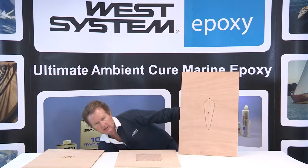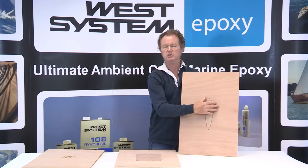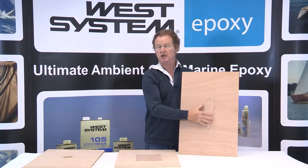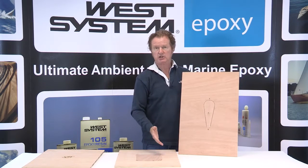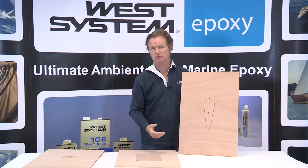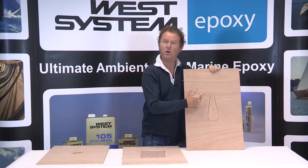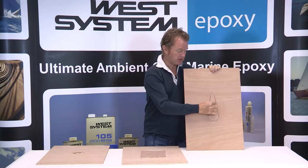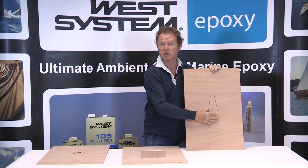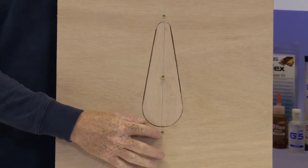Of course, this just illustrates techniques. We would want to do this with a thickened resin hardener mix, certainly using two-step bonding to provide best practice results. And of course, with this type of repair, it's quite feasible, once the epoxy bonding the repair in place has cured, to remove all these screws and refill the holes with thickened epoxy.